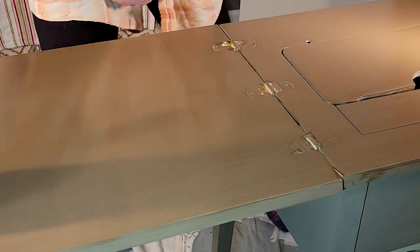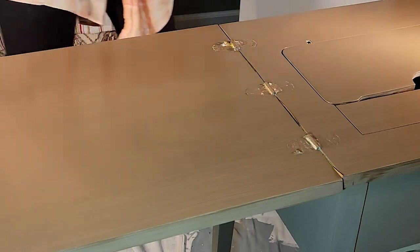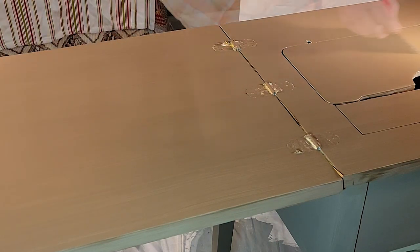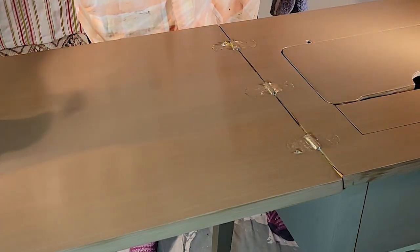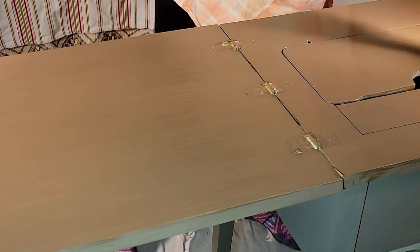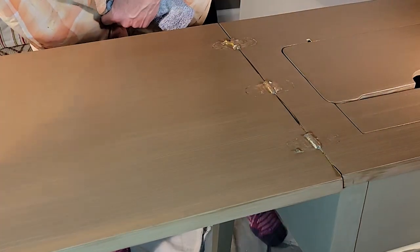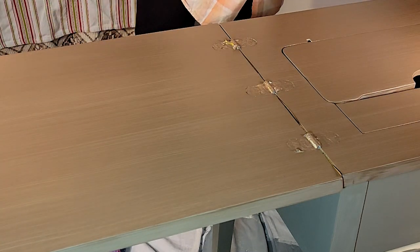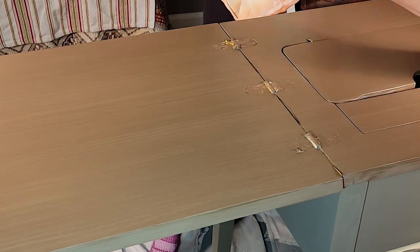I immediately take a big, fluffy old brush and start to wipe off the excess glaze, followed by a small little plastic broom. That worked good, but I saw a big difference when I went ahead and used a regular broom. Then I could really see the lines coming up. The problem with that was it was leaving all kinds of debris all over the surface.